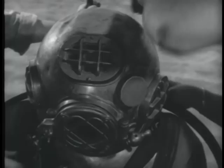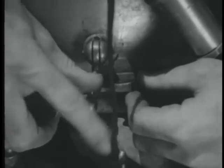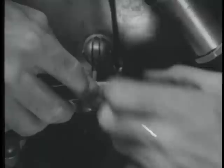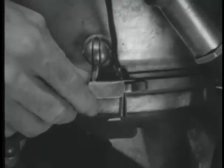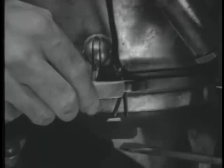As soon as the helmet is in place, the faceplate is opened, and then both tenders secure the helmet in the back, dropping the regular helmet lock and putting the safety lock in place, making sure that the locking device is secure. One tender dips the lifeline under the diver's right arm and fastens it by the signal halyard to the right front of the breastplate.